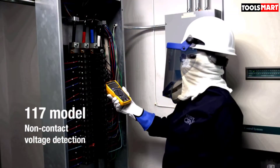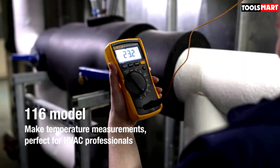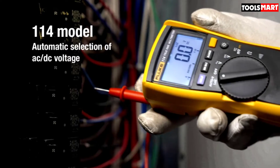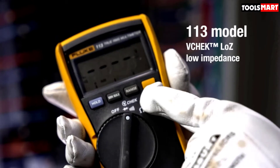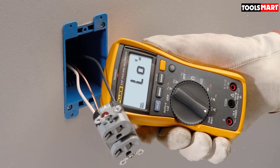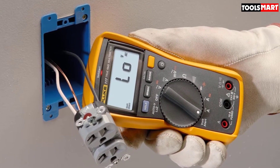Electricians can use it for solving electronics faults and general household work. Although it's a bit expensive than other multimeters, there's always a price for standard and quality products. True RMS is much helpful in bringing correct results for non-sinusoidal loads. In day-to-day jobs we face many types of loads, from general electric appliances to industrial-level machinery. High-power motors usually run with variable frequency drives and soft starters, which results in non-linear behavior of the overall load.